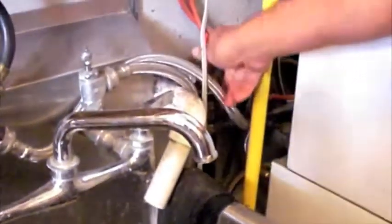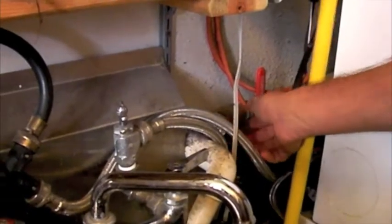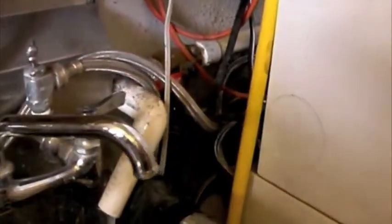This is where you can dive right into your regular drain that goes to the utility. Or you turn the handle up — handle up is gray water — and you can see how it starts running in here. This is the two-way valve right there. It comes around here and goes through the wall in the same place the other line goes through, and from there we're going to extend it and bring it to another area.